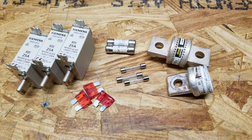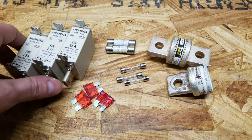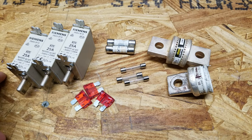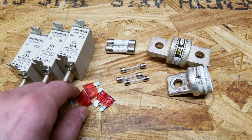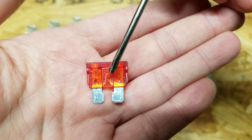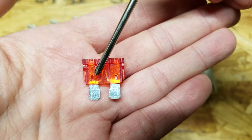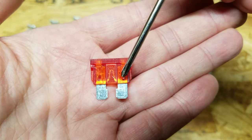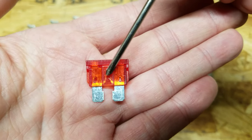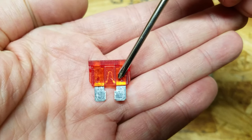Today we're going to talk about fuses and what types of fuses you should be using for a lithium battery bank. I see way too many people using the wrong types of fuses, the wrong size fuses, and fuses that aren't designed for the application they're working with. If you're using a fuse not designed for a specific application, you can get arcs that form across the two terminals in a short circuit event, which will burn extremely hot, cause fire, and the fuse is not guaranteed to break that arc.